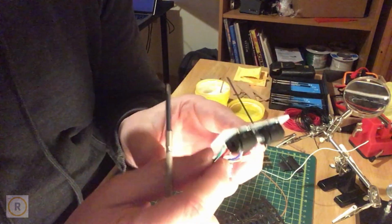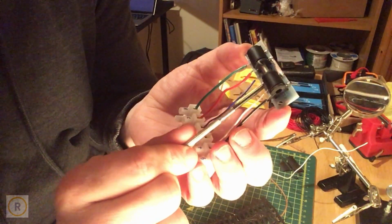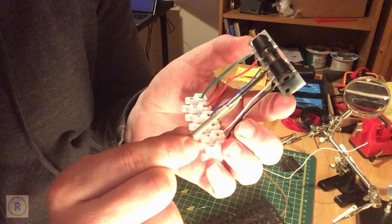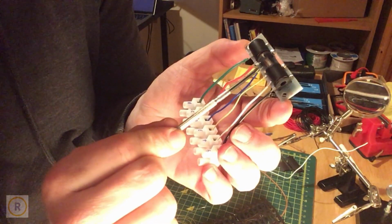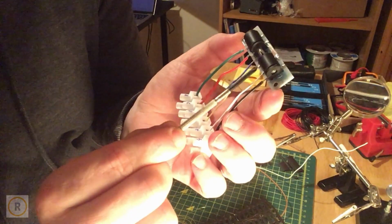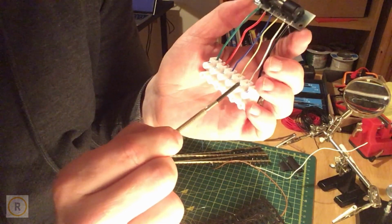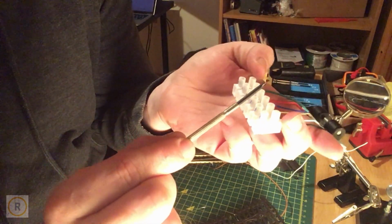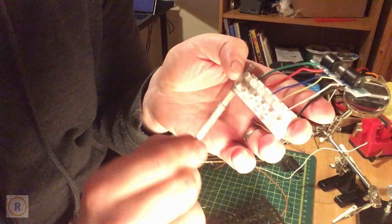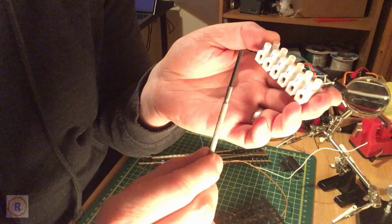Now where the polarity switch comes into play is when this goes left or right, it will make contact with either D or E in the middle. So what you do is you supply power to D and E, and whichever way this is switched, let's say D is positive and E is negative, if the point motor switched this way, contacting E, it will send that power back through F, which is this white wire here. So F is coming out of the point motor. What I use it for is to power the frog of the point, so it will switch the polarity of the frog to either positive or negative, depending on which way the switch is thrown. And I will also bring that power back to the control panel to power an LED.